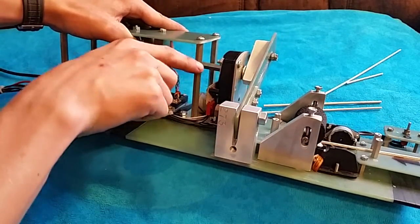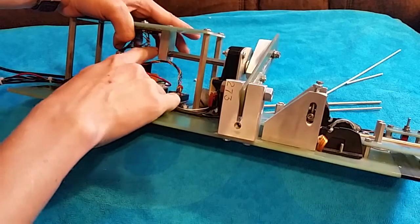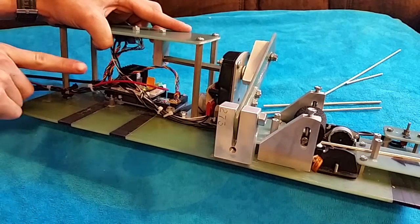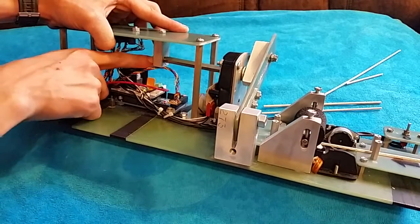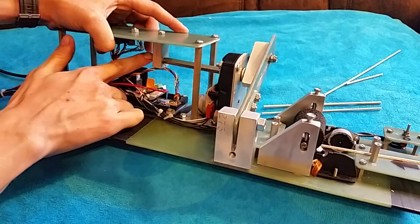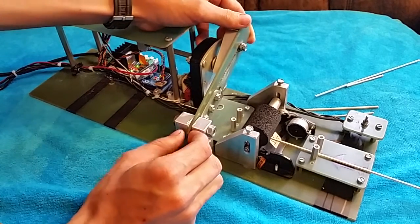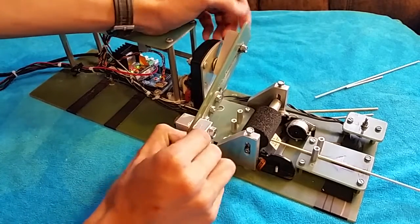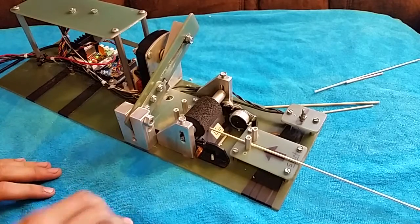It's got a steel square shaft that goes through here, and this is actually rounded over and threaded through this aluminum block. Over here it's just rounded over and gets pushed through this tailstock. Then that quarter-inch round, when I turn this down on the lathe, it's got small screw threads so I can put a screw in there to prevent it being pushed out — so there's no movement whatsoever besides up and down.